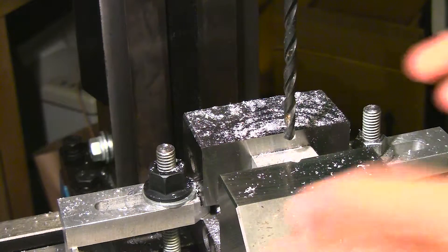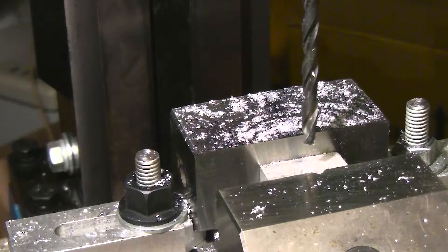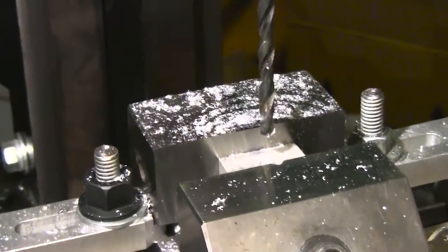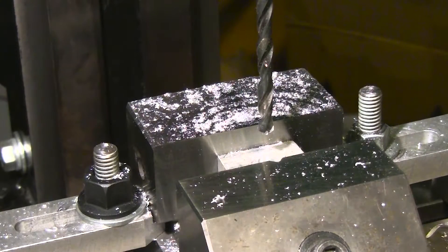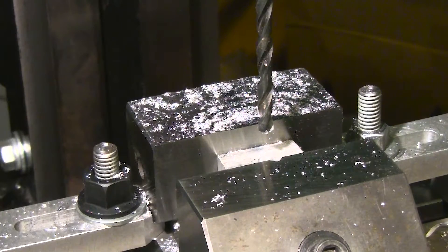I hope you saw how well the little mill behaves. Like I said, it's best to mount it securely to a really solid base — this thing resonates like a drum. This current setup is basically just for camera angles and accessibility. When I set it up in the shop it will be on a four-inch thick butcher block table with massive legs, and I'm going to weight it down. That's it for now — I hope you like the mill. If you're interested, contact LittleMachineShop.com — they have the new model available. If you like it please hit like, subscribe, and until next time, happy machining!